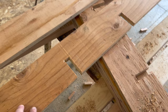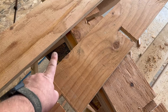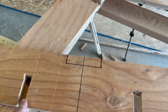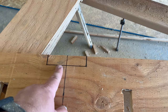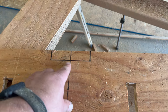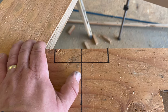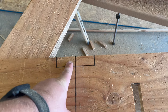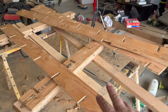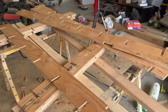One thing to keep in mind before you start marking and cutting: this side is up, so the slot for the sawhorses needs to come off of this side. Here's what I settled on: I drew a line in the center between these two slots — that was five and three quarters from the inside edge. For the slot that goes on top of the sawhorses, the sawhorses are almost exactly four inches wide, so I drew this out about four and an eighth inches wide and an inch tall, so there's a little wiggle room to get this onto the sawhorse. I'll mirror that on the other end, cut these two out, and then use it as a template for the remaining three. At this point all the cutting is done.